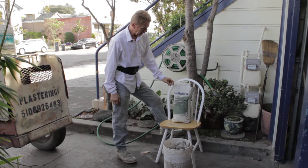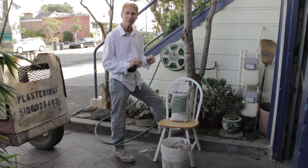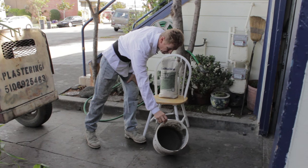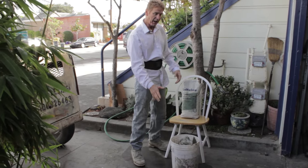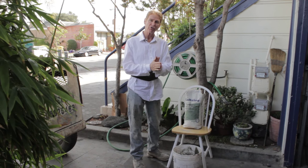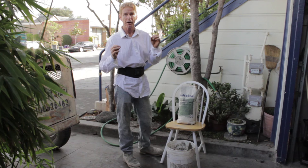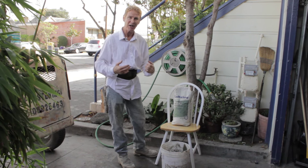This is the material I'm using - La Habra Polybond. It is specifically engineered for attaching styrofoam molds to brown coats because it has a bonding agent in it. I mixed some, then you wait a few minutes and remix. It's called slacking, the same thing you do with tile. I added a little bit of sand. This is just my way - I'm not telling you to do this because all the materials we generally show in our videos are designed for specific use. But since this is unconventional and not designed for this purpose, you guys don't do this. I'm just showing you what I do.